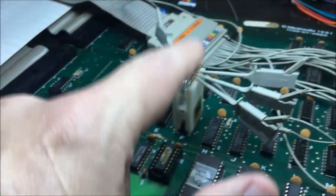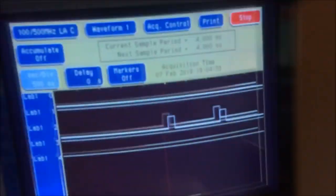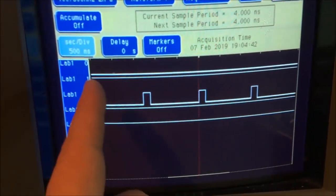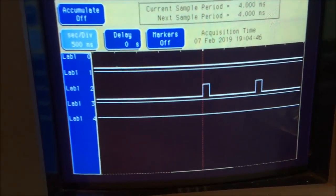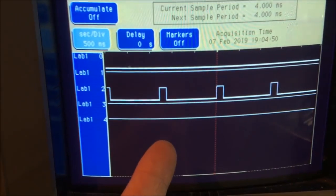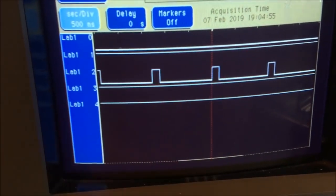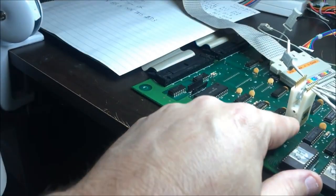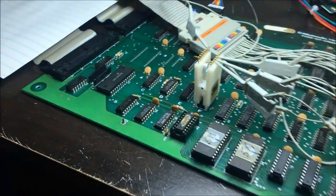Okay, I just got to the 4th and final switch in this mux, and the 4th one is the only one that looks like it's working right. It's always enabled, it says select 1, and it's always outputting 1. So this one actually looks right. The other 3 are all wrong. That is a huge issue. I'm going to have to replace that 157 because it's no good. Alrighty.